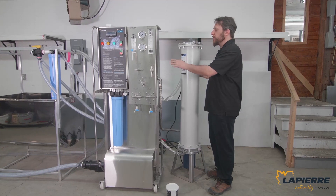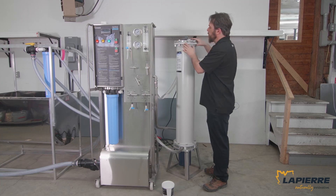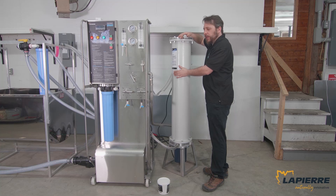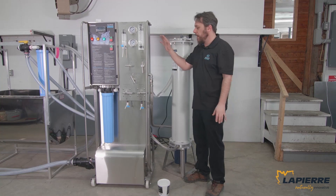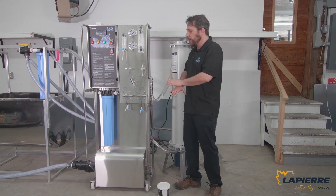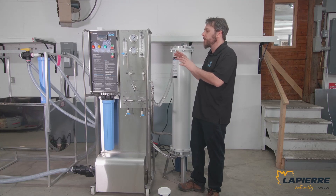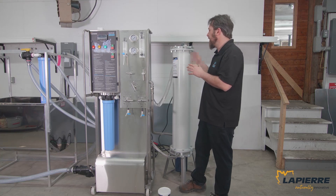Okay, we're getting ready to start the unit. The membrane is in the vessel, we've connected everything. I didn't tighten those too much — you don't need to tighten them much. It's not tightness that makes the seal; the seal is on an O-ring. The hoses are the same — not over-tightened. I did not connect the recirculation motor on this yet, just to make sure that everything is well primed and well rinsed. I like to do that running in the wash tank in closed cycle to make sure the machine is wet everywhere. A machine that was put in storage, even if drained properly, could still have a little bit of ice in the high pressure pump in the corners. By recirculating water we'll make sure everything is wet with no ice.